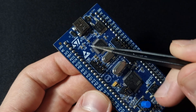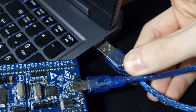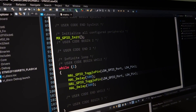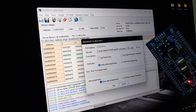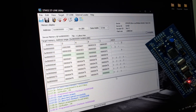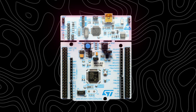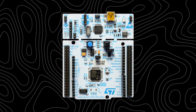The second are discovery boards that come bundled with a separate STLINK programmer. These work fine, but older ones may not be directly supported in STM32 CUBE IDE — instead, you might need to use another tool called STLINK Utility. And finally, there are official NUCLEO boards, which include modern STLINK debuggers built right in, giving you a plug-and-play experience with no extra hardware needed.